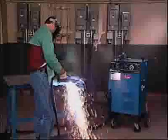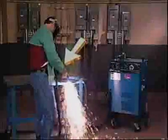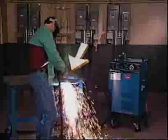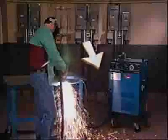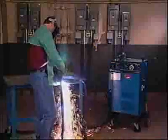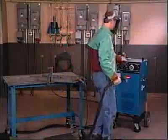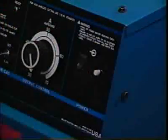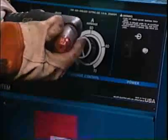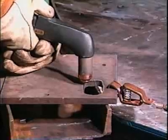Just as with welding, a complete electrical circuit is present from the power source and torch through the arc if cutting, through the workpiece clamp and cable, and back to the power source. However, plasma cutting requires much higher voltages than welding. For your own and others' safety, always set the power switch to off before installing or moving the workpiece clamp. Set the power switch to off before dismantling the torch. In addition, do not remove or allow to be removed the workpiece clamp while cutting.